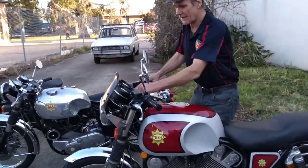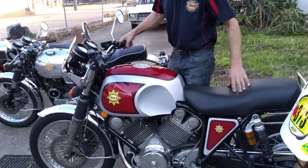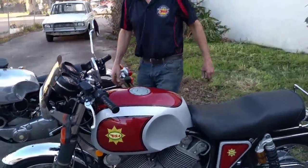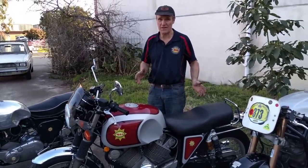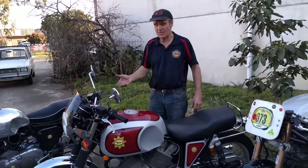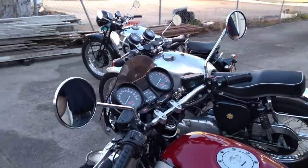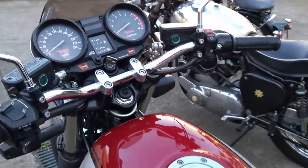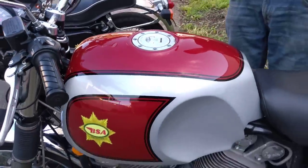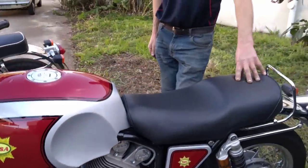I'll start her up so you can hear it. I've done nearly 7,000 k's on it and it's working very well. It doesn't have a great deal of electronics — I'm not that fussed with electronic control for absolutely everything. It's running carbs and points, as I can set those up myself. It's returning over 50 to the gallon. It has the niceties of heated hand grips, a 12 volt auxiliary power socket, a centre stand, a tyre pump, and many other little features I think are necessary for a modern motorcycle. It doesn't run a balance shaft and it runs no form of traction control — and it doesn't need it. The bike is smooth, really smooth. It's a 75 degree V-twin and it doesn't have any nasty vibration characteristics at all. I put that down to basically a heavy crankshaft, which makes it very flexible and easy to ride — not peaky, just pulls well.